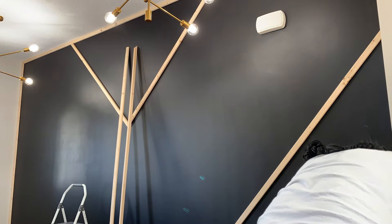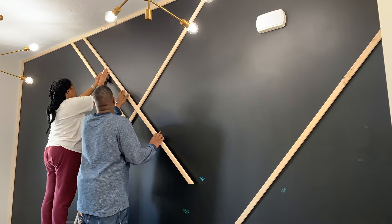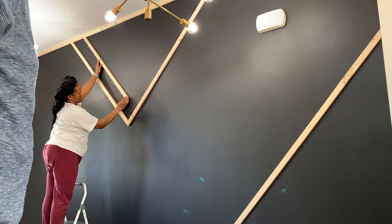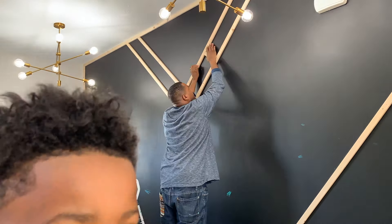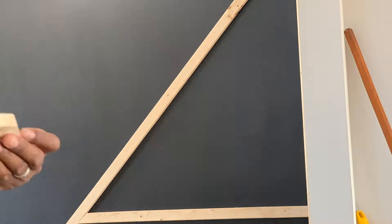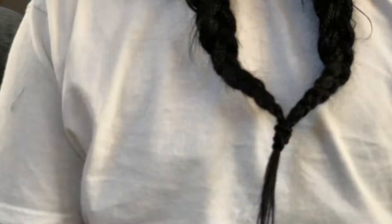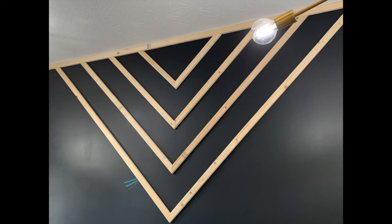We did mess up a few boards until we figured it out. When you want to make a 45-degree cut on one side, you make that cut, then turn your board around, flip it over, and make the other cut. That's the key tip — you don't want to cut the same board on the same side, because you'll end up with the same angle on both ends and it won't make sense. On this particular saw, there is a marker on both the right and left side showing 45 degrees. All you have to do is turn the little black handle to 45 degrees and make the cut.